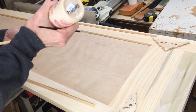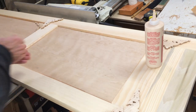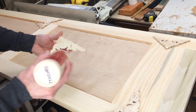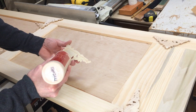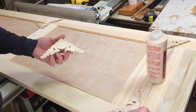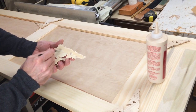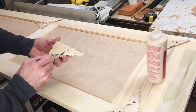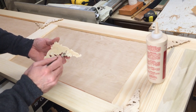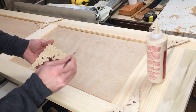Same thing on the bottom, then work from the sides because I can bend those into place where I need to. Those four pieces are in place. Now it's just a matter of putting the corner decorative elements in — fairly straightforward, just applying glue across the design and spreading it out. You don't want too much glue because you don't want a ton of squeeze-out. You might notice I've numbered these — the reason is to make sure that if I fit one in a corner and cut it, I don't swap it with another one, because it might be a different size.